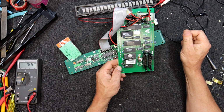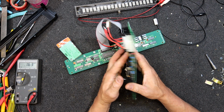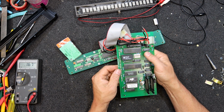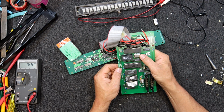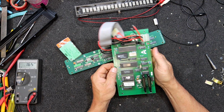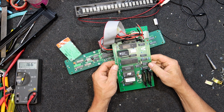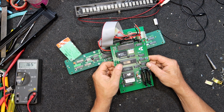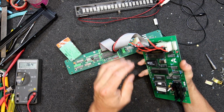Yeah, we've got our 1488, 1489 comms chips, which are socketed so they could be salvaged. 5.120 megahertz crystal. What's a little crystal? What were those things? It's more than just a crystal, but it's a little crystal oscillator module thing. So it's got some drivers or whatever in there. A little sort of self-contained oscillator pack. I think you supply power and get your frequency out of it. Oh, we'll look up what those Intel chips are, but other than that it might just end up in the e-waste.